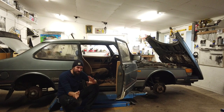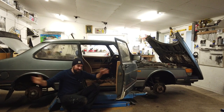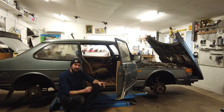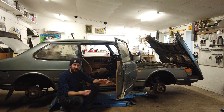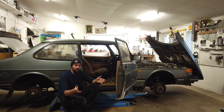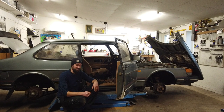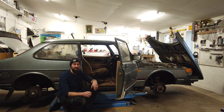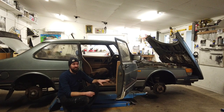And maybe this video is slightly boring and slightly long if you are interested in the whole car, because this is pretty much just something specific. But I know from experience, back when I had my 900, that it's a common issue that you have key problems on the old Saabs. Very often it's because you lent the car to someone who didn't know about that reverse gear thing, and then they just pulled the key out or pulled it into neutral before putting in the gear. And so a lot of people are having issues with that.